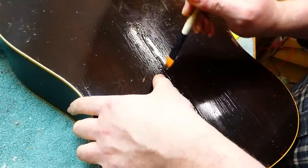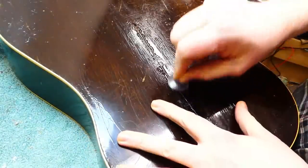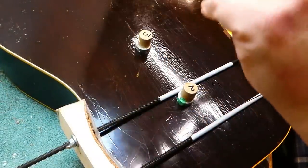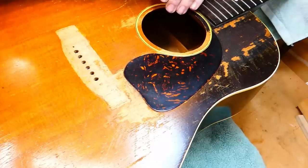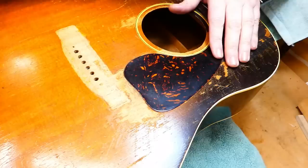There were numerous back cracks, both long and short. I got glue in them, pumped it through with the suction cup, then clamped using various methods. I used magnets to keep the two sides level with each other while applying the clamps.